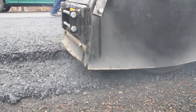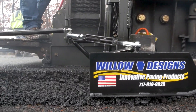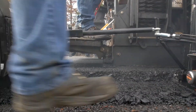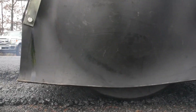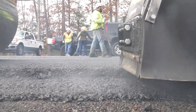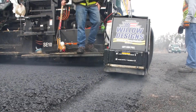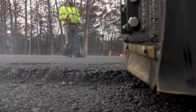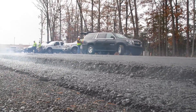You can really see the definition. This loose material that's in this area — the difference between the way this wedge looks and this material here, how loose it is compared to how much tighter it is now and how defined that edge. That looks really, really good for base course. You can even see right now how defined we're creating that vertical notch and confining that loose aggregate.